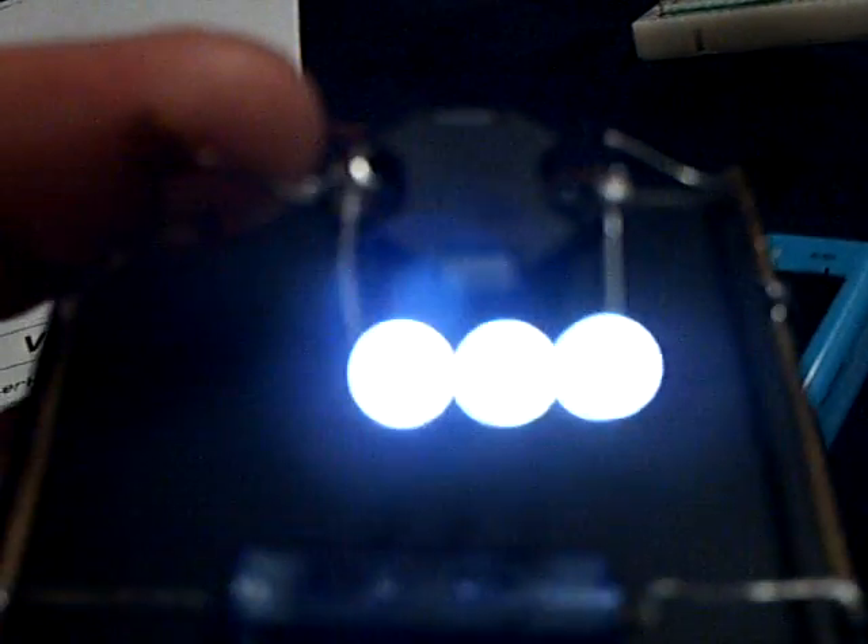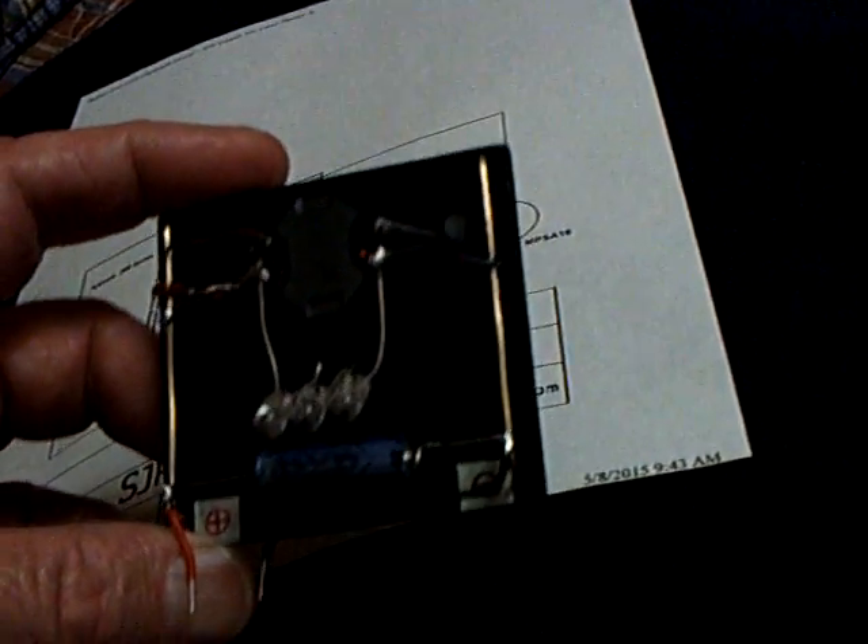On this one, I built the board so that if you touch the capacitor right here, the LEDs come on bright. That's the effect I was going for — this touch device. When you touched it, it went on bright, and I thought that was the coolest thing. So I made this board with those little brass wire rails and put the whole circuit between the rails. When this is charged up with the battery and running, it's drawing 2.5 microamps. When I touch the capacitor, it goes up to a few milliamps, and that drains that 440 cap down in a hurry.